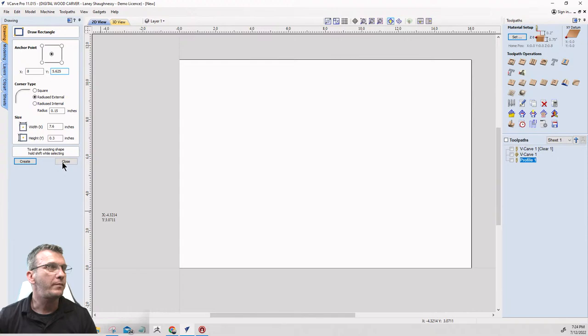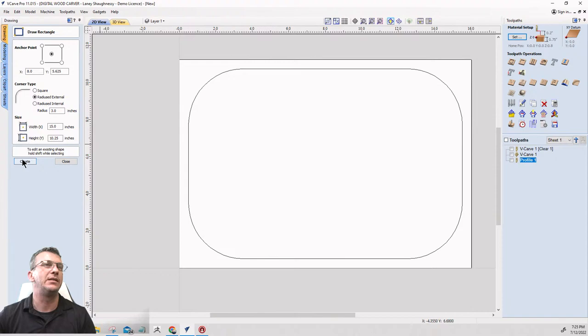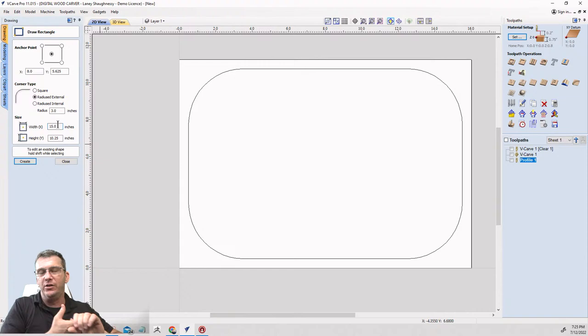I want a round corner radius — I'm going to do a 3-inch radius on this rectangle. I want to come in from all four sides by about a half inch, so I'll take my width and subtract one inch from it (half on each side), hit Equals. Then take my height H and subtract one inch and hit Equals, then create that boundary centered on my board — a half inch in on all four sides with a 3-inch corner radius.